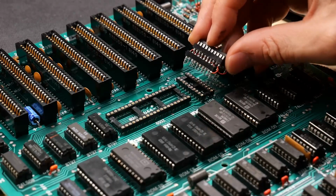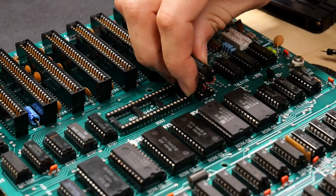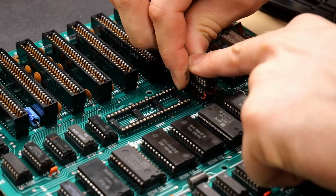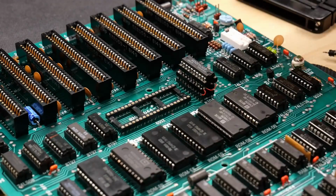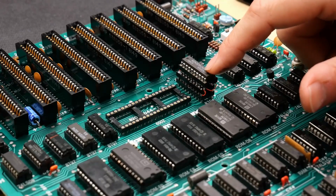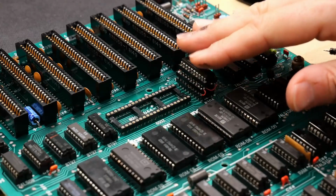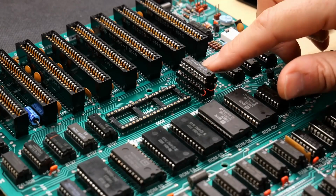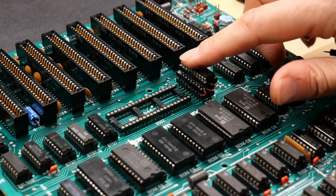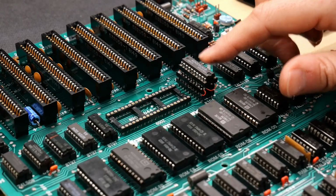But anyways, I did some Googling looking for people talking about this particular swap, like if they couldn't find the 8304, and I didn't really find anyone talking about it. But I looked through the data sheets to make sure that the direction pin that controls if it goes from A to B or B to A is the same on both chips, and it is. Both chips take the direction signal and work with it in exactly the same way, and the A and the B sides are on the same sides, so theoretically, this should totally work.